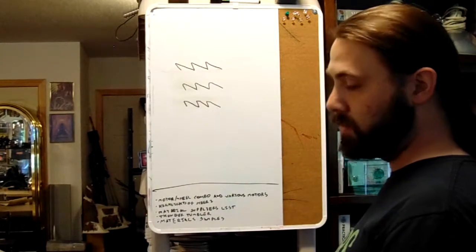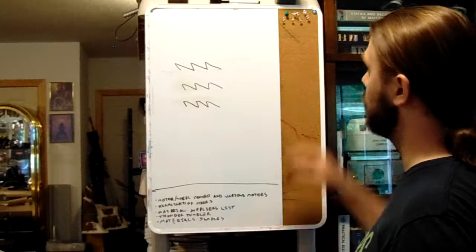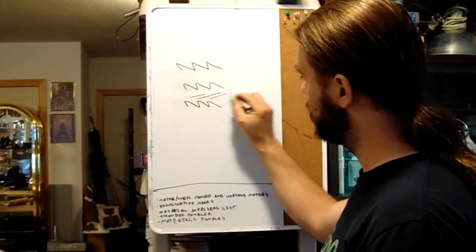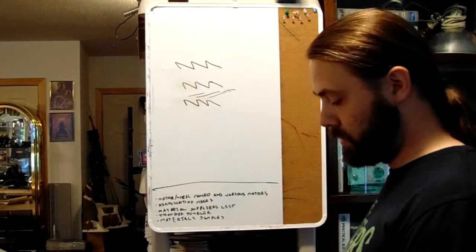Or, you know, sometimes you will hit something hard unexpectedly, or testing a piece of metal, and you'll dull your file a little bit. But that's how you sharpen it. You essentially just sandblast it in this direction, and it's going to knock that rounded edge back off of those teeth and bring it back to where it'll cut again.